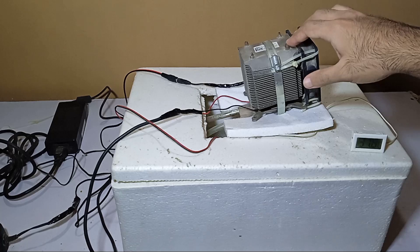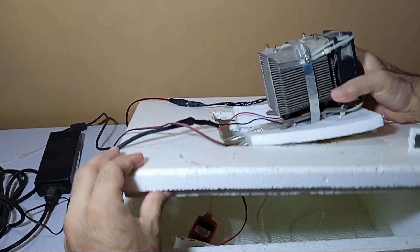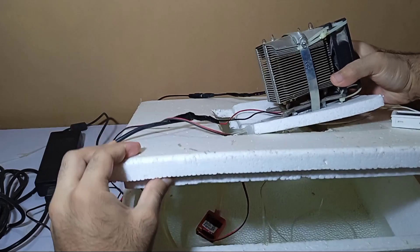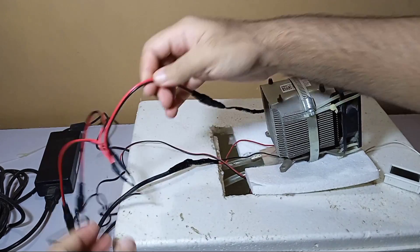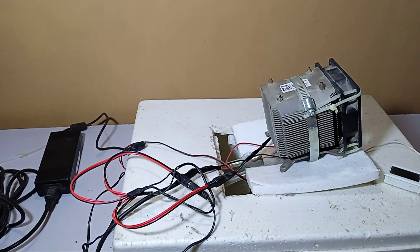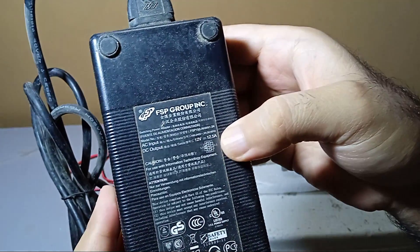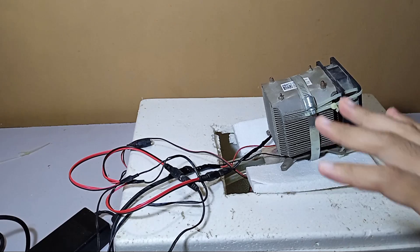On the inside there is nothing else, just water — 5 liters of water in a 25-liter thermopol box. I have placed separate wiring for the fan and the pump: 12V at 3 amperes for the fan and pump, and 12V at 12.5 amperes for the Peltier alone.